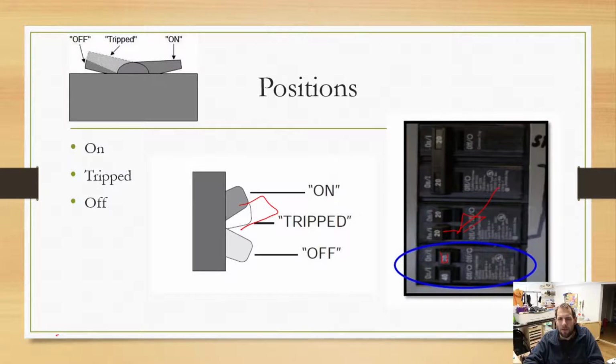Is it because of something you did? For example, my family was visiting once, and all of a sudden our toaster oven wasn't working. I'm like, why isn't the toaster working? And someone's like, yeah, the microwave's not on either. Toaster, refrigerator, they were all off. I was like, what's going on? What caused this? After thinking about it, I think we had the toaster, the hot water, the hot electric tea kettle, the microwave, and the refrigerator all running at the exact same time, and they're all pulling a nice chunk of power. So we probably just pulled too much power and tripped the breaker. Once I went down, found the breaker, and turned it back on, everything turned back on.